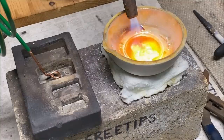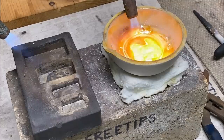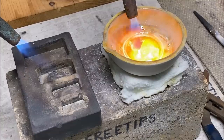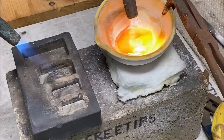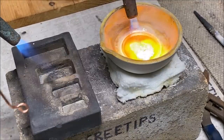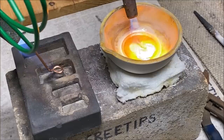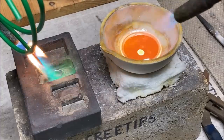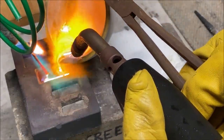Now that I have the silver molten, I'm going to pull the copper wire out of the way and start heating my mold with another torch. I'll tilt the dish to get the pieces of silver that haven't gone molten yet to coalesce into a single mass in the melt dish. Here comes the tricky part — I'm going to put the wire back in the mold cavity, and then once I do that I've got to pour the silver right away, or else the copper wire will melt. Now we take our torch and pour the bar into the red-hot copper wire, and it should weld right to it — just like that.